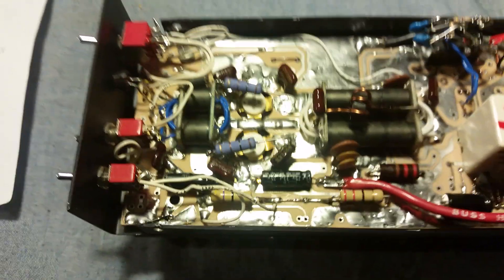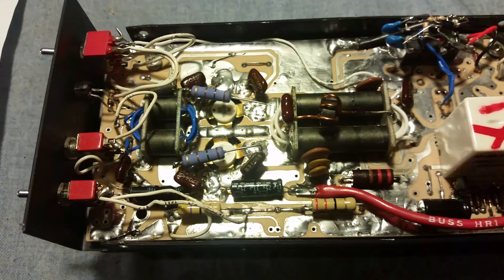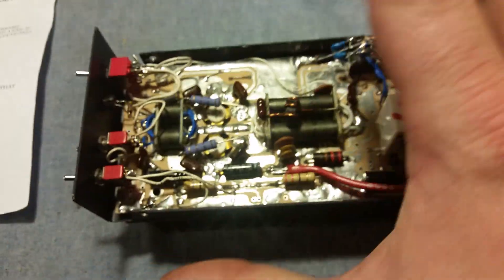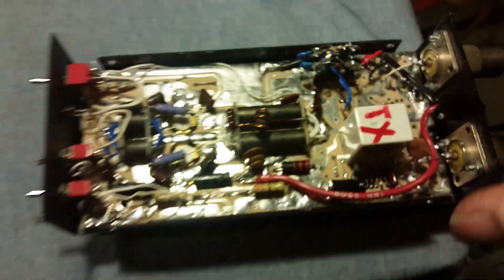I dropped in two feedback circuits — they didn't add feedback circuits back then for some reason, so I made sure to add that on all these amps. It just gives you a little extra safety. Then I went ahead and did the conversion — taking all the caps out, making sure everything's one big ground plane. You can tell where I've done that here, over there, right down in there, and right over here — basically where all the screws were.